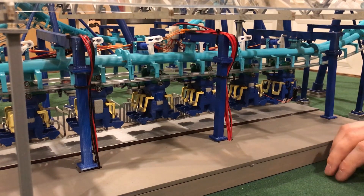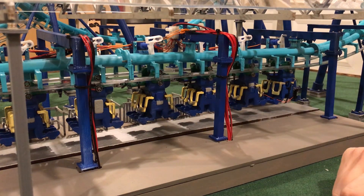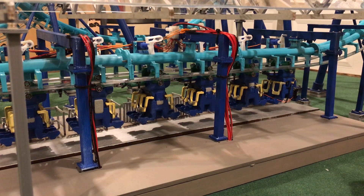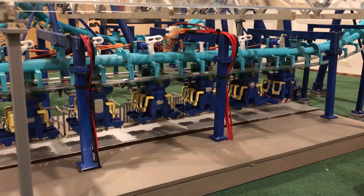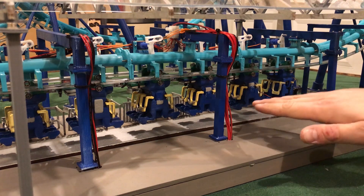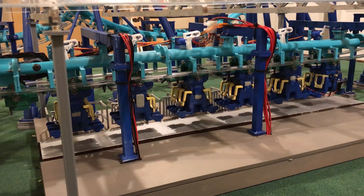Alright, so let's talk about the station really quick. Each train car has its individual plunger that will go down to let the restraints go up. The last train car does not have the plunger installed because I have a camera sitting on the front seat, so there's no need to lift the restraints on that one. Other key features are the gates behind — they're controlled with four-bar linkage, pretty simple — and the floor is the same thing, it drops and lowers, all powered by micro servos. There are six individual servos, one per car, and the computer homes the train after each run so we can lower the restraints and open up the gate.